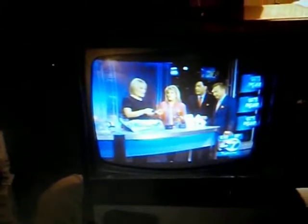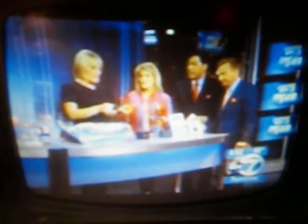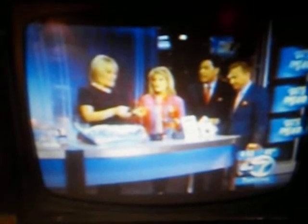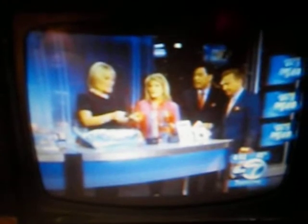Okay, I'm making this video to see if I can help out a Video Karma member. He's got a Zenith TV here that's got a tint issue. I don't know how well this is coming out, but he's got the tint rotated fully counterclockwise, I think he said it was, whichever way is to make it more purple, and it's still too green. So he has a lack of tint range. So the tint control is working, it's just too green. So we're going to try to address that.